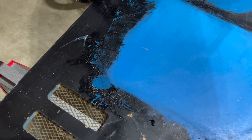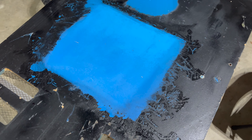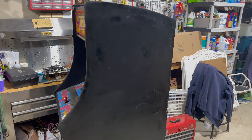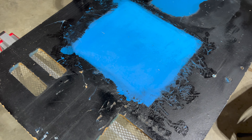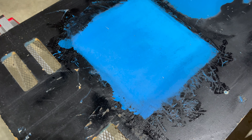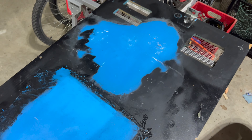After cleaning it up just a little bit, it looks fantastic. This is absolutely the technique I'm going to use to strip the black paint off the sides of the cabinet. We'll lay it on its side and do exactly that. This required no work compared to the magic eraser approach — just two minutes of setup, then let it sit for 10 hours. Going forward, maybe I'll do 8 hours, but that worked really, really great.